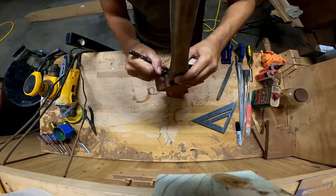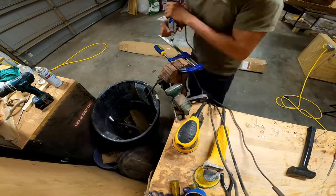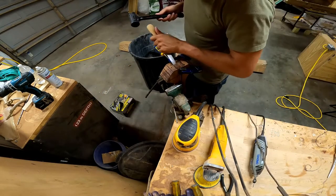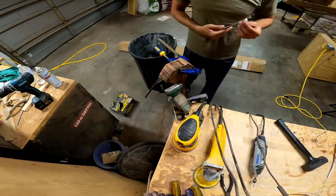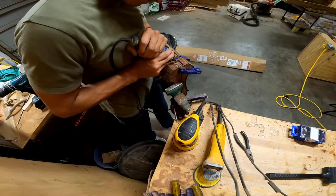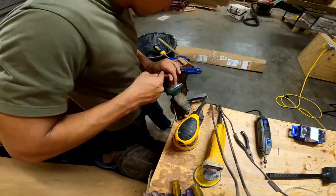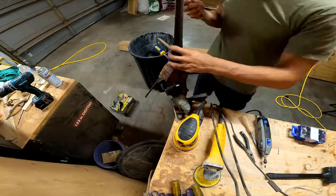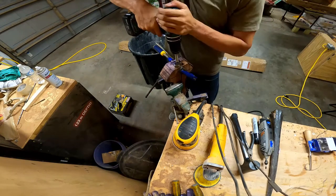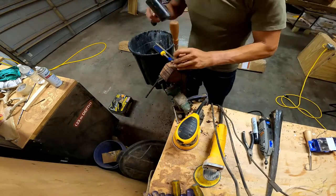The inset is not going to be very deep — only about three-quarters of an inch, maybe an inch deep, but that's plenty. I'm using the Dremel here just to shape out the initial section and chiseling that out. I want to make sure that I have a good tight fit with the marlin bill, so I don't want to take out too much wood before I verify that. Once I check that out, I'll take a different drill bit, drill out as much as I can, and clean up the edges with a chisel. I've marked on the bit how far deep I need it to go so I don't take out too much wood, otherwise it can be a pain.